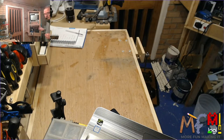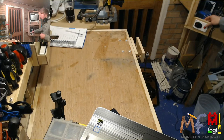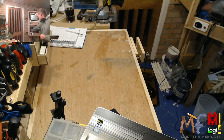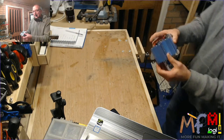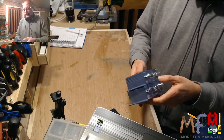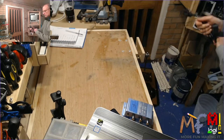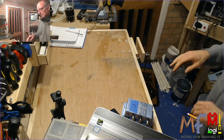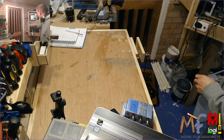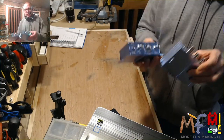Right, so this is the back of the pinball machine, and you might be able to work that out. Bass speakers here. This is all new. You'll see this in the next episode, so sneak peeks for you. This is the power inlet with a fuse switch and a button for the PC there. These are the amps for the exciters for the surround sound feedback part of it. So there's a separate built-in amp in the Logitech speaker in here that's got its own separate volume controls, and that one does the sound that comes out of the speakers in the back box and the bass speaker. And then the inside, we've got the four exciters that do the feedback. And those are driven by these Swish amps.